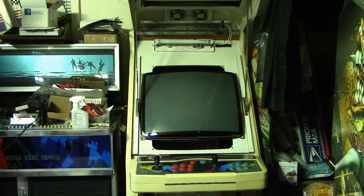But I don't understand it because even though I'm using a standard monitor and a standard JAMMA cabinet, I'm using the Mike's Arcade adapter, which has a built-in inverter, which is designed to take that reverse or inverted video and invert it back into the standard video signal, so it should display properly on the monitor. Now, I have seen where some people reburn the video PROMs on the board. I believe they reversed the digital information on the ROM, which allows it to output standard video, which will work on a standard monitor.